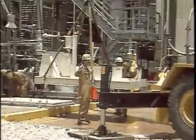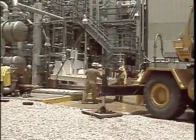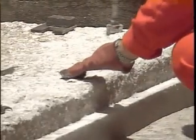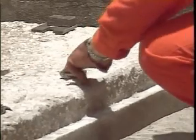If necessary, place the base plate on the foundation to verify fit and to mark the concrete at the point of the jack screw contact. For installation of the jack pads, some type of marker should be used to locate the precise location of the jack pad in relationship to the jack screws.